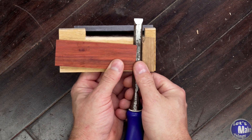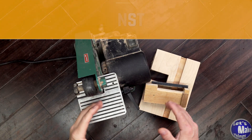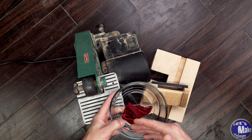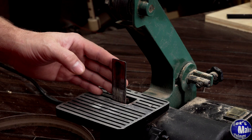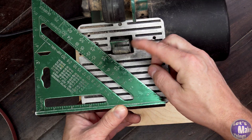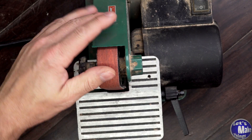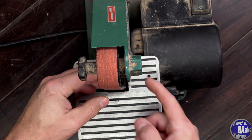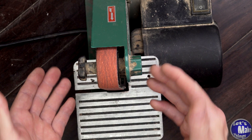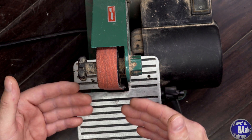When it's time to use it, this will slide right up next to our blade. You'll use it by putting pressure on this side and then using your hand to slide it on this side. To get started, we need to get a few things ready. First, grab a bowl of water or a damp rag — you'll be checking the blade's temperature regularly and cooling it off between passes. Second, this piece of metal back here, which is called a platen, needs to be parallel to the front edge of our table. I've taken off the belt so that I can use a couple squares to check that it is parallel. If yours is not parallel, there should be a couple screws in the back that you can loosen to move it around and then tighten up really good. After that, we'll slide the belt back on, making sure it's flush to the platen in the back. As for the abrasive, I'm using an old worn-down ceramic belt. It's seen much better days, but that's what makes it perfect for this — it still cuts, but it doesn't leave deep grooves that I'm going to have to polish out later. The finer or more worn your belt is, the better it will work for this kind of bevel reset.